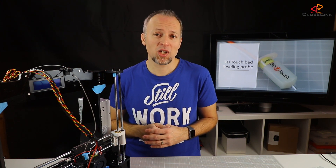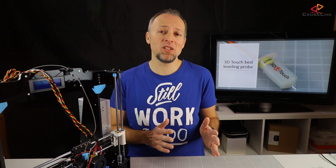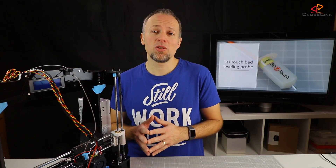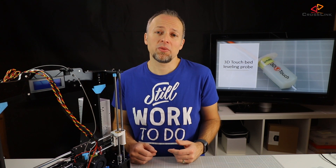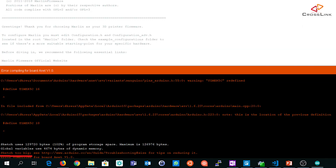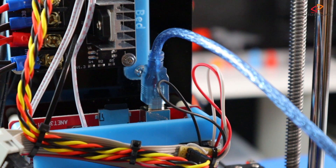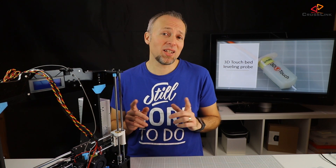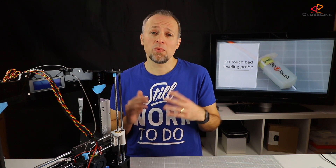Now, since we have made all the necessary changes, everything should be fine, right? Well, not so much, depending on what kind of features you enabled in your firmware configuration. In my case, I have enabled the new Anet A6 display and the beeper together with auto-bed leveling and the 3D-Touch. This makes the final firmware binary too big for the available ROM on the mainboard. So I had to flash the new firmware using an Arduino as a programmer device. If you are getting a compiler error saying sketch too big, you are in the same situation and flashing using the normal USB cable is not an option anymore. Even with using the programmer, I still had to disable some minor features to make the firmware fit to the ROM. You can see this in the configuration files I provided in the description down below, if you compare them with the original ones.